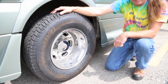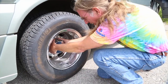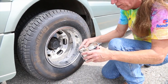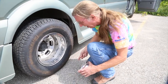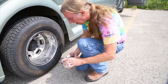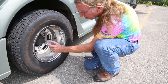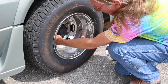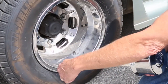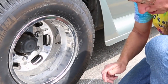How do you take it off? Well, if it's easy to take off, you can just pull it straight out like so. You'll usually knock the spring off and you have to get it back. If it's been on there for a while, the best thing to do is to get something short, about this long, and stick it behind the lip right here along the face of the thing and pry out there. Don't pry on the end or bang on the thing sideways — you'll break the plastic.